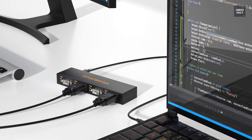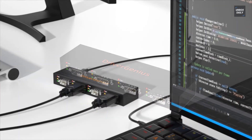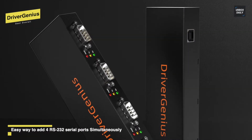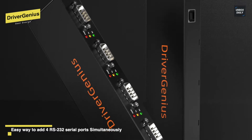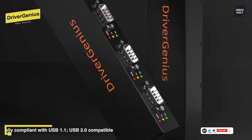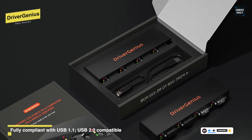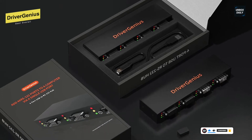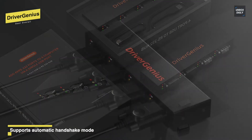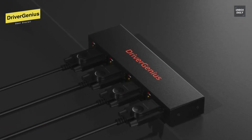Let's begin with the Driver Genius. This Driver Genius 4X RS232 4-port USB to DB9 RS232 serial adapter hub is a durable aircraft-grade aluminum that can stand up to minor shocks and drops with zero issues. It has a matte black finish, which makes it easy to keep clean. It measures 7.3 inches wide, 1.9 inches deep, and only an inch thick. The four DB9 RS232 ports are located across the front of the housing, and at the back there's a USB Type-B port for connecting to your computer, and a USB Type-A to Type-B cable is also included in the kit.